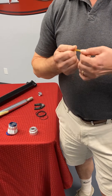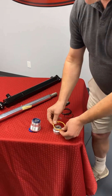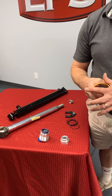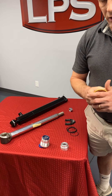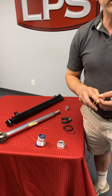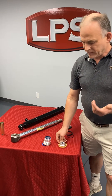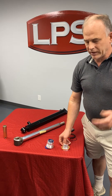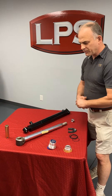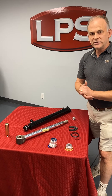You've got to stretch the seals. I soak them in hot water to make them softer so you don't damage them. Stretch them very carefully, get them on there, wrap some shop towels around it, and I use a hose clamp to squish them back into place. It's kind of a redneck way of doing it, but that's how I learned — I used what I had in the shop and found a way to do it without damaging stuff. I'm sure there are other ways, but they require expensive tools that nobody has. That'll get your seals replaced; put it back together, put it back on, and you are good to go. Thank you for your attention, and I hope this is helpful.